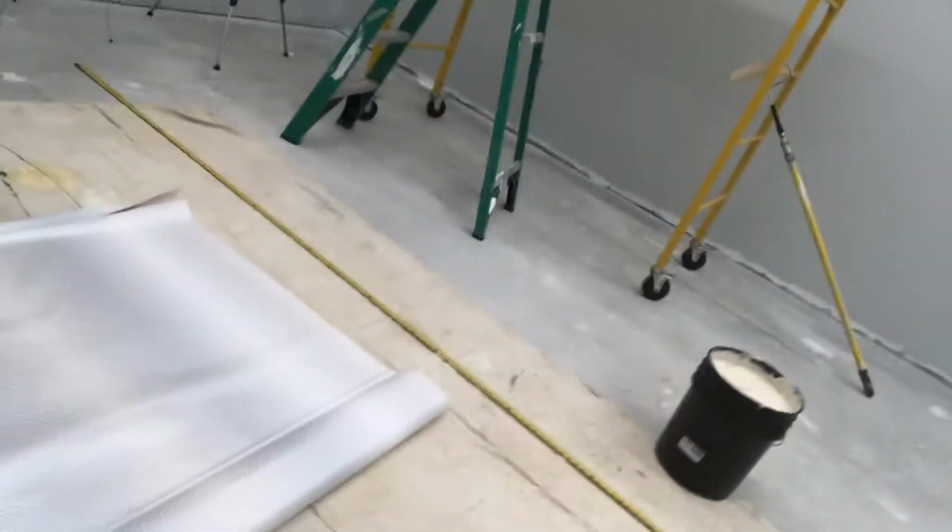But so we have a Wolf Gordon installation, and I cut the first video. I don't know if I said it already in this one, but this is our second Wolf Gordon installation for the week. It's a beautiful paper, 54-inch commercial paper that you see booking on the ground here. Now, what is booking? Booking is the process by which the fabric on the wallpaper absorbs the moisture in the glue so that the fabric in the wallpaper and the wall can become one. If you don't let the paper book, you will have numerous bubbles and you will have a bad installation. The paper will fail. You have to follow those guidelines.